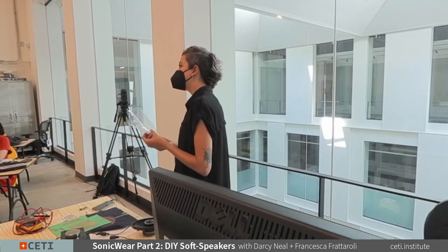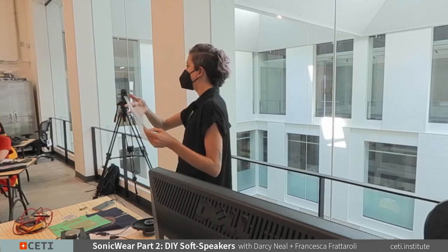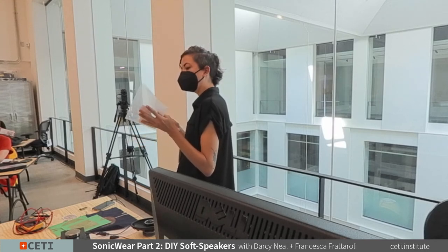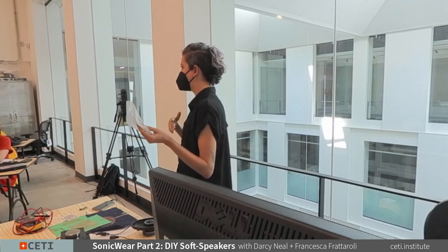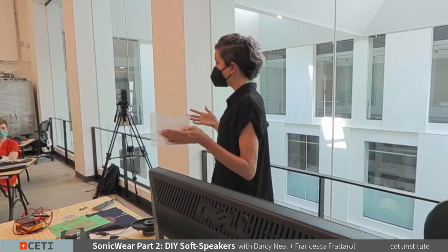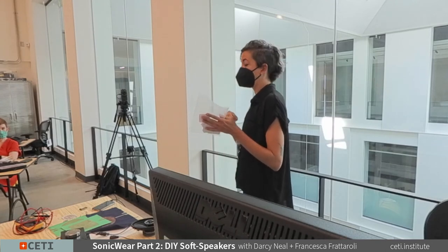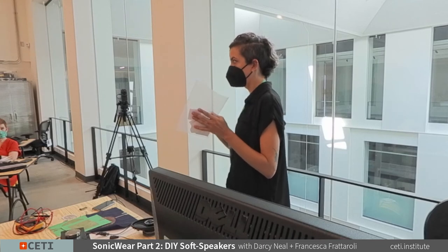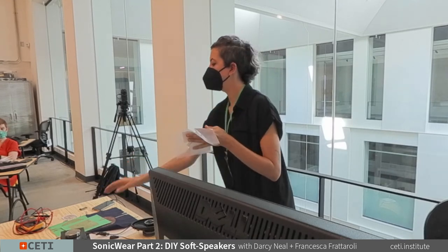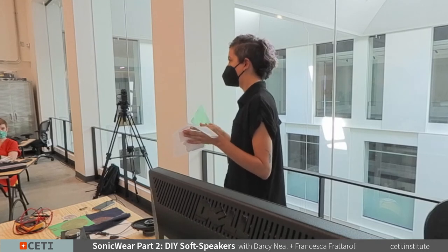We did a vinyl cutting demo yesterday, so I don't remember who all was here for it, but the vinyl cutter is available. So if there is something that you want to design and then cut out, we can totally help you with that. If you know how to use a vector file like Adobe Illustrator or Affinity Designer, that is going to be best for designing it precisely how you want. But if you don't know how to use a vector program, you can also draw it on a piece of paper in a high contrast color, like a high contrast black and white image, and then we can help turn that into the vector file that we then cut out with the vinyl cutter. So we have that workaround available. You could just work with something that you could draw on paper.